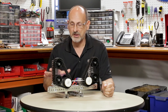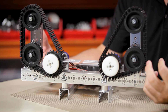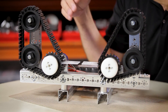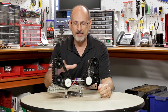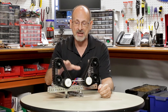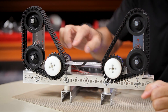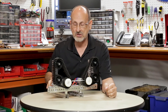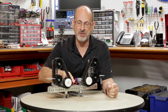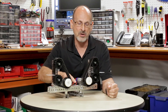One of the first things I want to show you is the encoder functions. It's important for our First Tech Challenge users to have encoder applications on the motor so that they can drive to a certain position or use them on an arm to control movement. I have a rig set up here to demonstrate the motors being synced together and tracking and maintaining a position together. On this rig we have two belts with a paddle meeting in the middle.